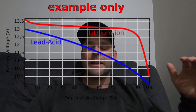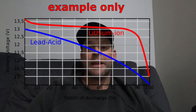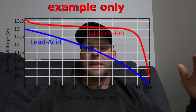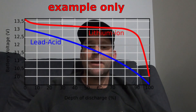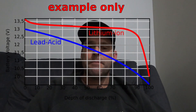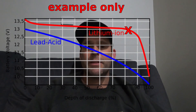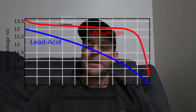This is because in a lithium battery the volts stay relatively high as the amps drop down. So as you get down to around the 20% point of a lithium battery, you'll still be showing high 12s or low 13 volts. If you're reading that on a voltmeter, you'll think you've still got plenty of battery capacity left, but in reality you could be as low as 20%. In an AGM or lead acid battery, as amps draw down the volts drop significantly more in comparison — it's a more linear scale. With lithium batteries it holds a steady line and just drops off around the 20% mark, so a smart shunt is the best and easiest way to monitor your battery health.